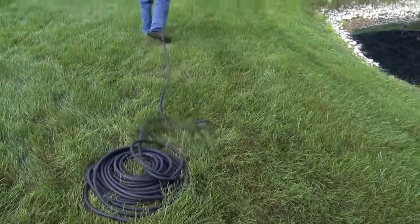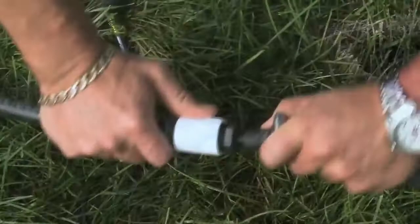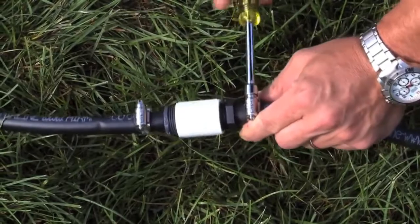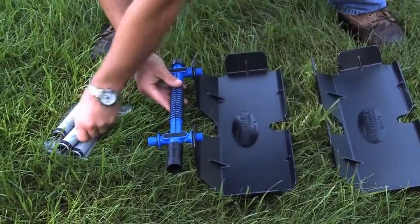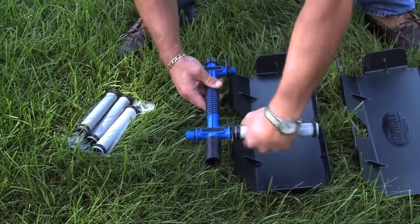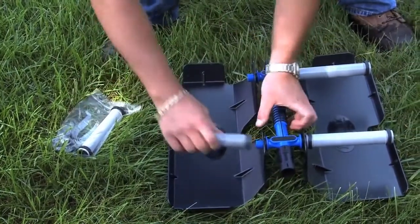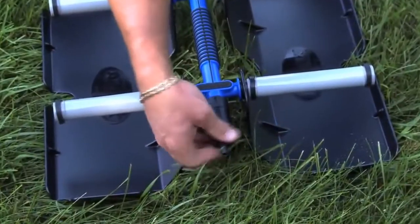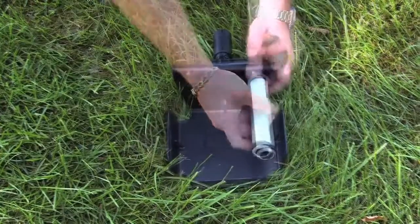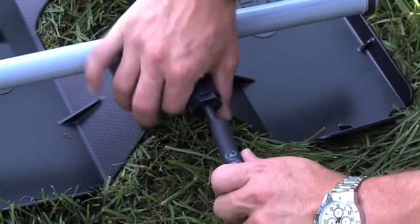Unroll the EasySet Airline. Having the airline unrolled will make installation much easier by removing any twists or possible kinks. Connect your EasySet Airline to the direct burial airline using the provided connector kits. You are now ready to assemble your AirMax ProAir Diffuser Plates. For ProAir 4 Diffuser Plates, align the diffuser manifold with one diffuser sled, hand-tighten two membrane sticks, and repeat for the second diffuser sled. Depending on the size of your airline, screw on a corresponding reducer fitting. ProAir 2 shallow water diffusers are just as easy — simply thread the two membrane sticks directly into the manifold. Once your diffusers are assembled, connect the EasySet Airline.